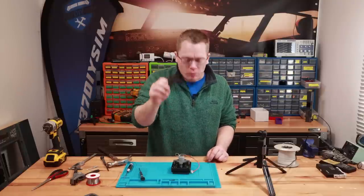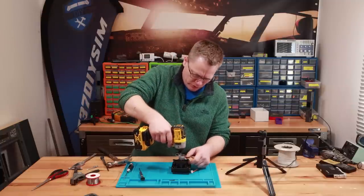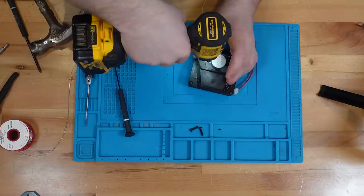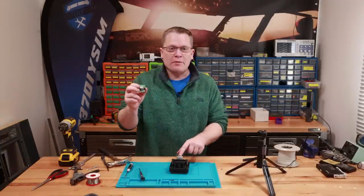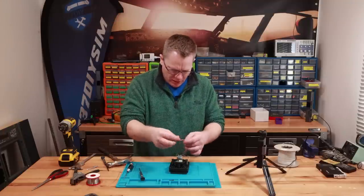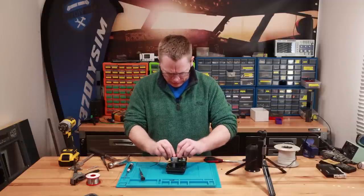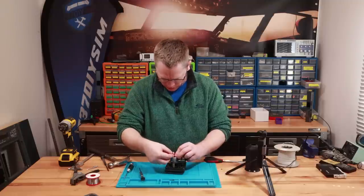On the back side we've got this stepper motor control board — this support bracket holds it in place with a few M4 screws. This is the stepper motor control board that came with the stepper motor — it just slides into the slots. We've got the stepper motor cable connected. This cable is a bit long and looks messy so let's tidy it up — loop it around on itself and use some lacing cord to hold it in position.